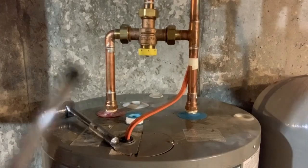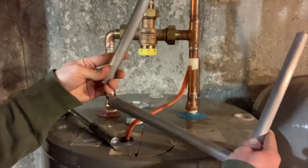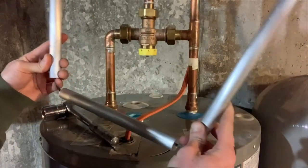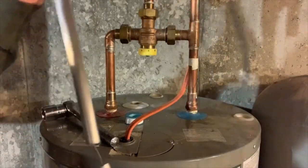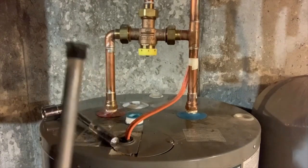So as it turned out, when I brought this over to the hot water heater, it was actually a little bit long, and that's okay. That's the other nice thing about these nunchuck style ones: I was just able to snip this last one off right here, and now it's plenty short to be plunged all the way in here without hitting the bottom of the water heater.